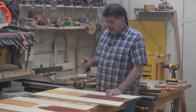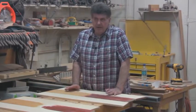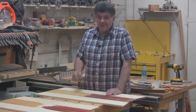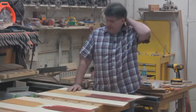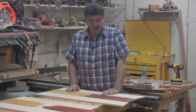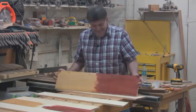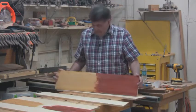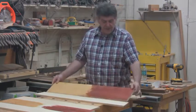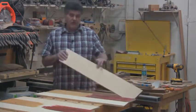Now, what I did, like I said, I took a piece of four-quarter I had, and it was heavy, about an inch and an eighth, and I resawed it. It actually started out as one of these thick pieces we were using in some class, dealing with blotch control and different things like that, so you can definitely spot which one it is. It's kind of hard to miss, huh? Anyway, once we surface it and finish it up, all that'll come off. But here's the thing I'm going to do. This is my resawn side